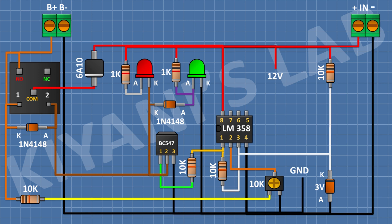After that I'm gonna connect a 1N4148 diode and connect its cathode to pin number 1 of the transistor and its anode to the anode of the green LED. We have completed all the connections — now let's test the project.